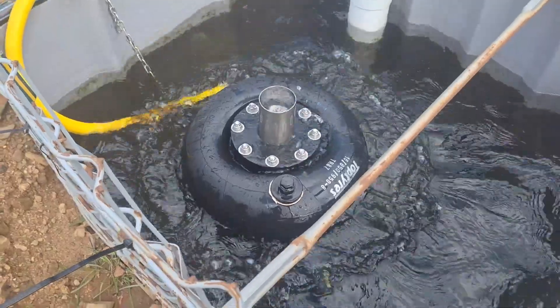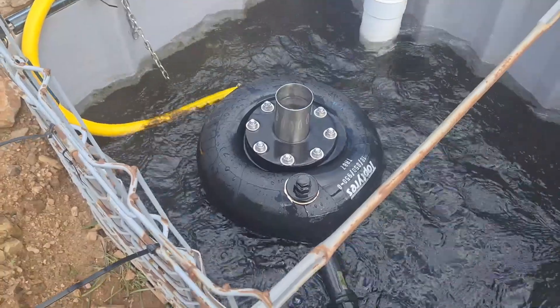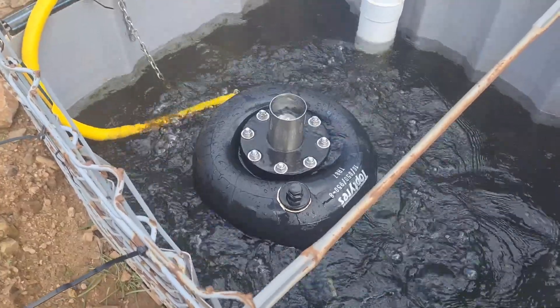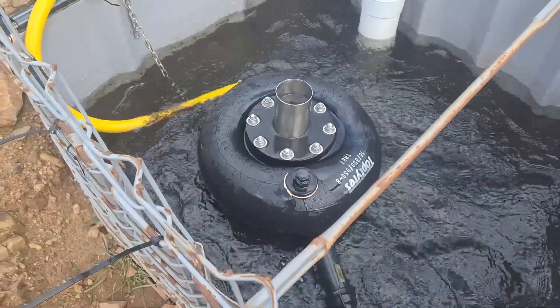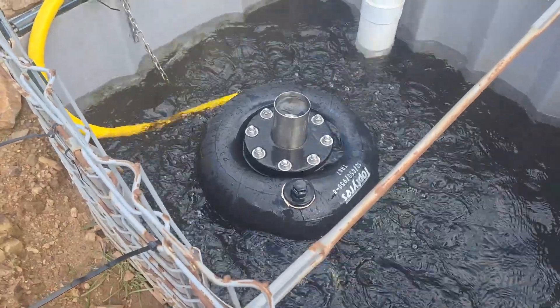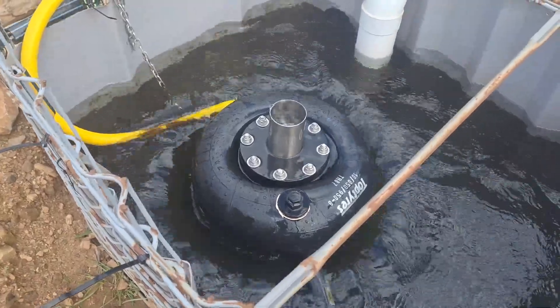With a shorter stroke just before, it was pumping three and a half liters a minute — a bit over five thousand liters a day. We'll go up to the tank and tap and see if this has increased after making the stroke a bit longer by about 12 millimeters.